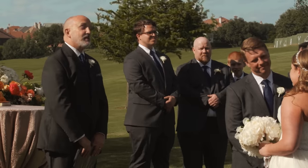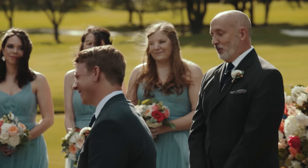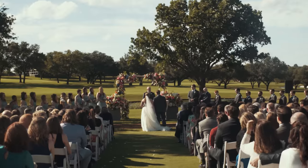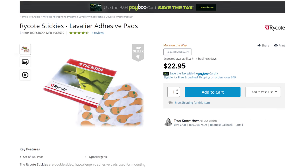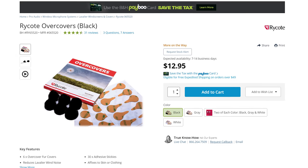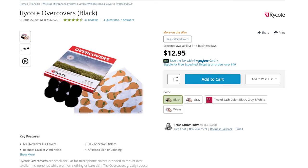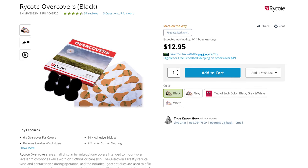Keeping on this lapel clip theme, let's talk about the third accessory I recommend for the DR-10L. Sometimes you'll be filming in a windy environment, like an outdoor wedding ceremony. In this situation, I would not recommend using the standard lapel clip because the mic will be directly exposed to the air. Instead, I recommend investing in a set of Rycote stickies and overcovers. These let you attach the lav mic to a shirt or jacket, and they're sticky enough to not come off. Then you place an overcover over the microphone, which helps insulate it from clothing rustle and provides even more wind protection. I bring these to every wedding I film.